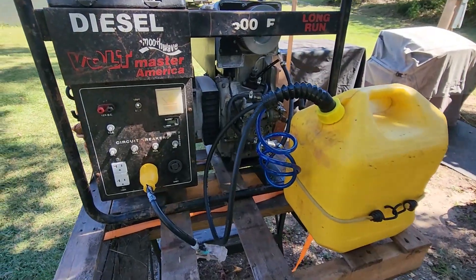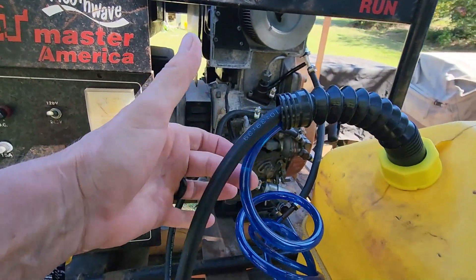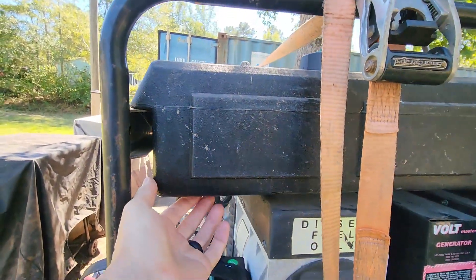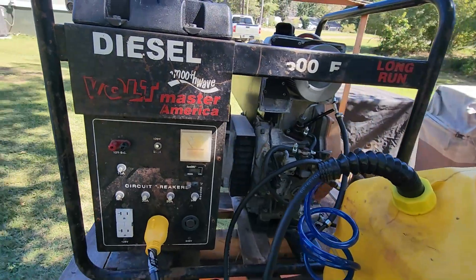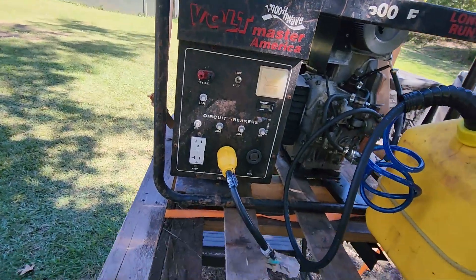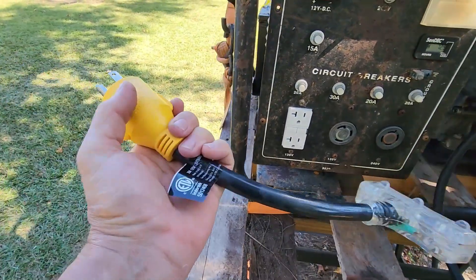I got the old generator running. I had to use a temporary fuel tank — got the suction line going to the lift pump and then a return line going in there as well. I had to do that because the fuel tank fitting was clogged up and it broke when I tried to get it off. I was able to order a new valve for the tank, but we had a hurricane come in a couple weeks ago and had to get this ready to use. We ended up running it for about eight hours and had to replace the GFCI outlet here.